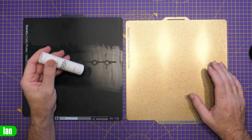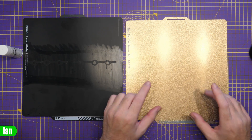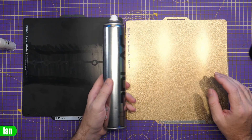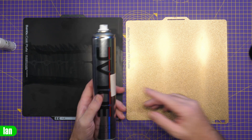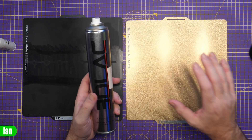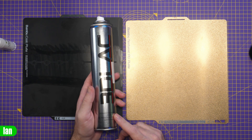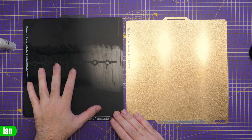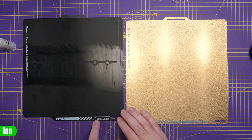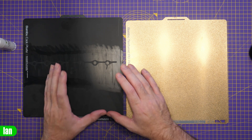There is no great need to use the glue stick to help release the print from the textured PEI plate, because the chances of damaging this sheet are very, very low. If you are having first layer sticking issues on this plate, you could use glue stick, but my advice is to use something like 3DLAC. It's basically hairspray and gives a slight tackiness to the sheet to help the first layer stick without problems — something I've used many times over the years. With regards to the cool plate, this is where the glue stick is important. It is less about making sure the print actually sticks to the bed and more about being able to release it.